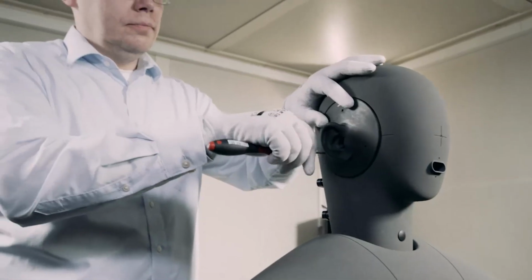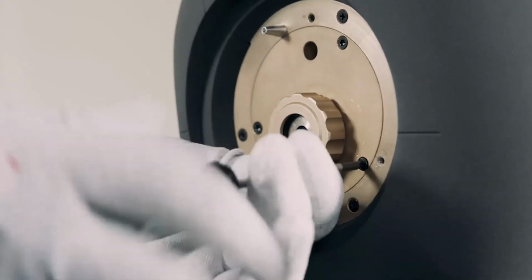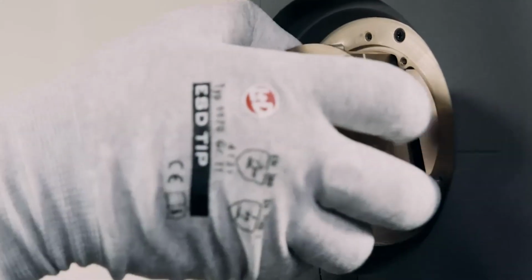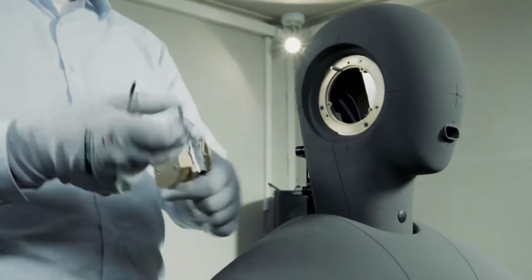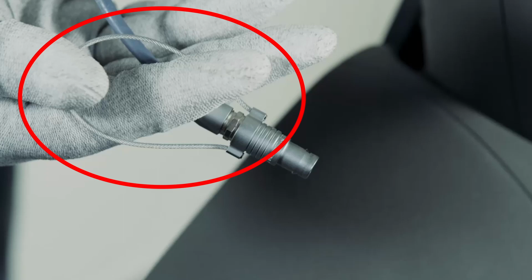So, as in years past, if you're familiar with the Head Acoustics product line for head and torsos, we have 3 little hex screws that we use to attach the pinnae to the head. Once you remove the pinnae, we have 3 additional screws that fix the coupler to the egg, the shell of the head and torso. Once those screws have been removed, you can now remove the ear simulator, and if you look closely inside, we are using a very short LEMO cable to attach it to the connectors inside of the head. Now, if you've used LEMO connectors before, you're aware that there's a sleeve on it that retracts the hooks in the connector. What we've done is we've installed a little metal loop onto that so that even people without very dainty fingers can go in and grab the connector and release it.